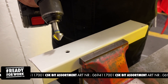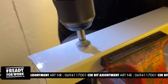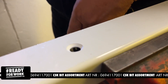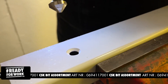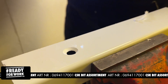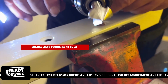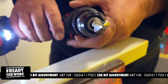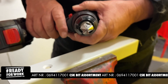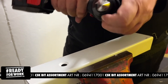Here I've got a piece of plexiglass. I've already drilled holes, so now you can see. The countersink has started — it's a 90 degree. As you can see, it's got three cutters, so it doesn't leave a nasty indentation on the countersink hole. So this is the plexiglass.